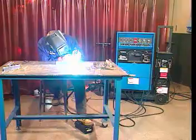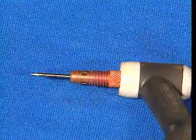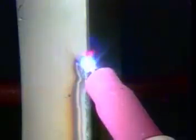In this part, we looked at the equipment that is commonly used to perform TIG welding. We saw that this method uses a non-consumable tungsten electrode and is commonly performed using direct current straight polarity. Take some time now to try a question about gas tungsten arc welding.